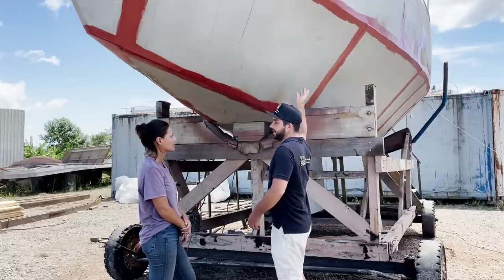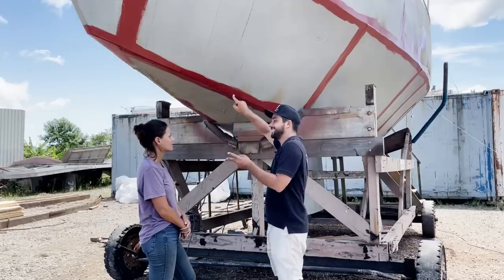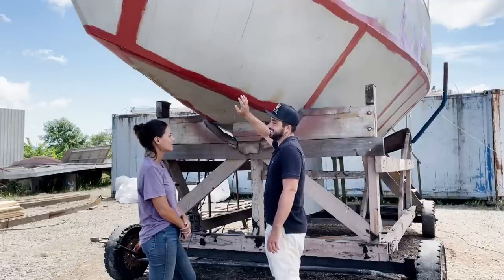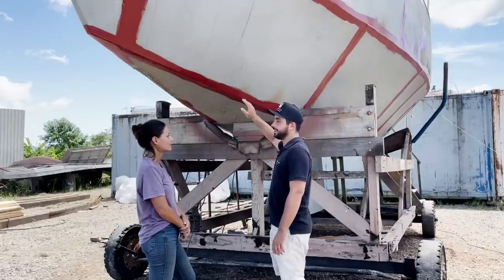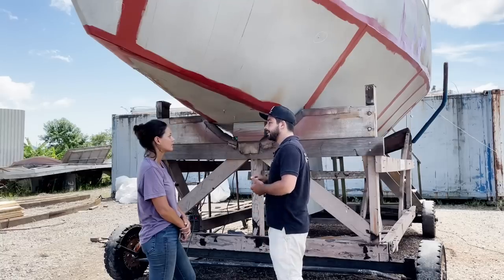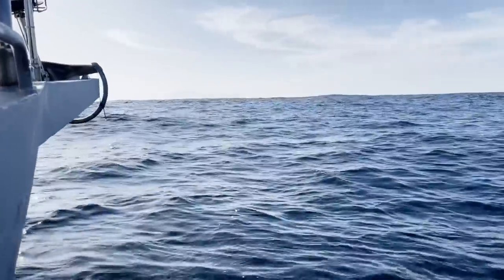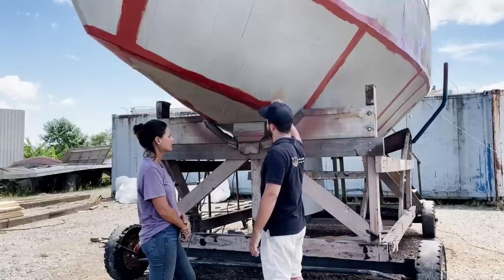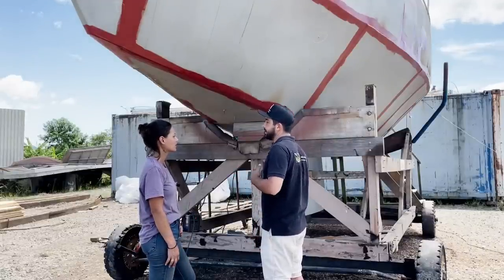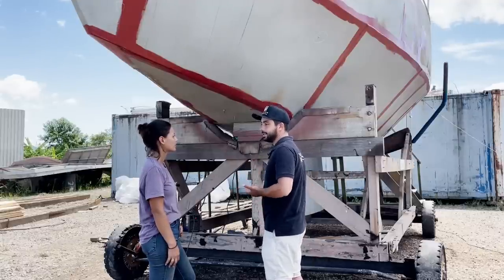I think you did the right thing — just to sand all the excess, fill all the porosity, and now with this anti-corrosion paint it's the first step of many layers until the white paint. We need to remember that this is just one of two sides of welding. When we say we are sanding, we don't mean we are taking out all the welding strength, just the excess. On the inside we still have a pretty strong weld. Where you've got water flowing you need a smooth surface, because all the texture from the welding creates drag and you start to lose a lot of speed.